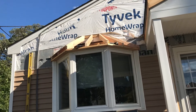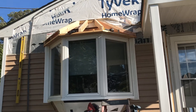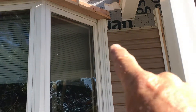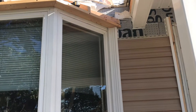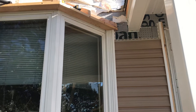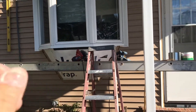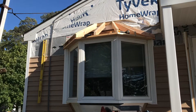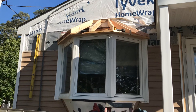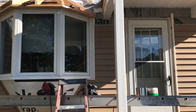My name is Len David Hart. Here's a bay window I'm working on — I made these window casings a little wider than the original. I'm putting siding and trim on this job; this window was already in. I wound up rebuilding the bottom and then the top as well. It's not a perfect hip or a perfect roof, but it's a little better, and I extended it out so it's going to cover my side casings.